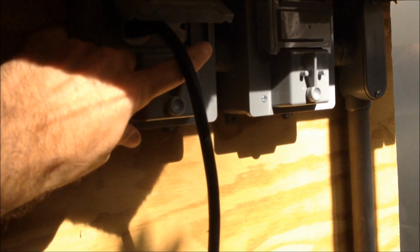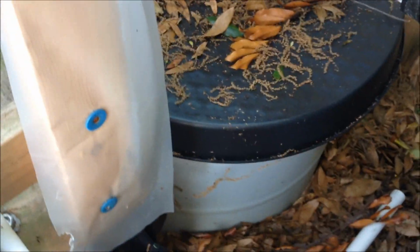Go ahead and turn the pump off. And what I like to do as well is plumb things to make things easy, so you can just turn things on and off here. So turn the pump off. You can see we have a 3-inch bottom drain. This is, I believe, just a Rhino bottom drain. And a 3-inch pipe is going to come, of course, under the pond over here to this 55-gallon pre-filter.